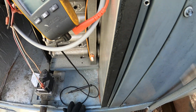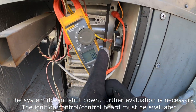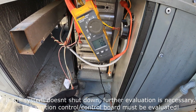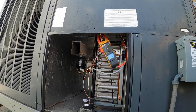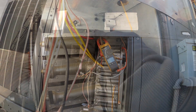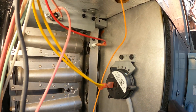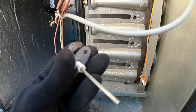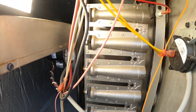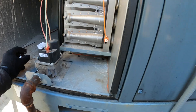The flame stopped. You're going to want to make sure that happens because this is a safety device. It tried again and it's not going to hold because there's no wire. Right there it went off again — this one checks out. We actually just replaced it but you can check yours as well. Put the wire back, make sure you've got a good connection, and there you have it. This is a very basic and simple control but super effective and extremely important. If anyone found this video helpful, please drop a like, comment, and subscribe — I come out with new videos every week.